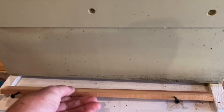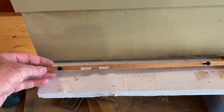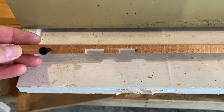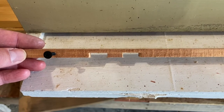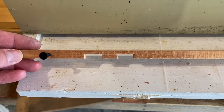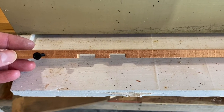This is a finished product, but I take my cut-down little piece and take it over to my dado blade, and I cut two entrances into it that are just big enough that bees can go in and out, but small enough that a mouse couldn't get in there. I usually do two, just to give them an entrance and an exit - or two exits or two entrances - but just small enough that a mouse couldn't get through.